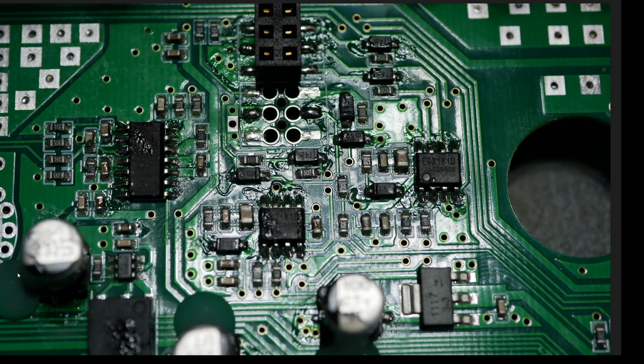Same thing down here on this little 6-pin chip, you can see that the solder is very even and smooth. It's not shiny, no flux around it, because that was done by a machine that placed the part, placed a little bit of solder paste on the joint, heated the board up, and let everything all flow together. You can see the same thing on this regulator. Everywhere that you can look, you can see that very, very uniform soldering that is so indicative of machine reflow soldering.